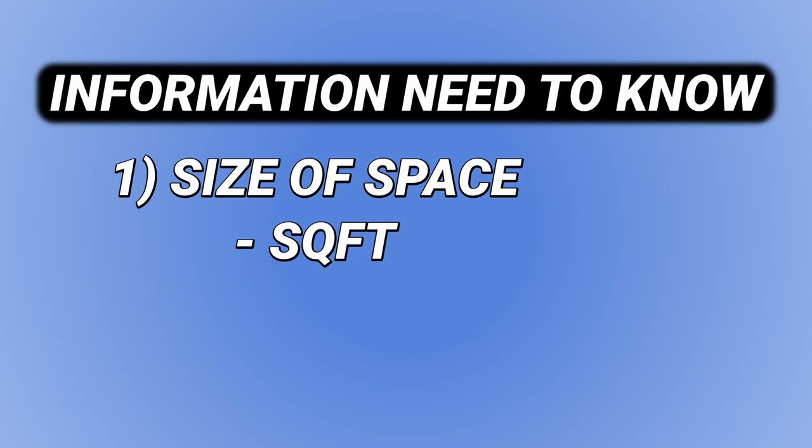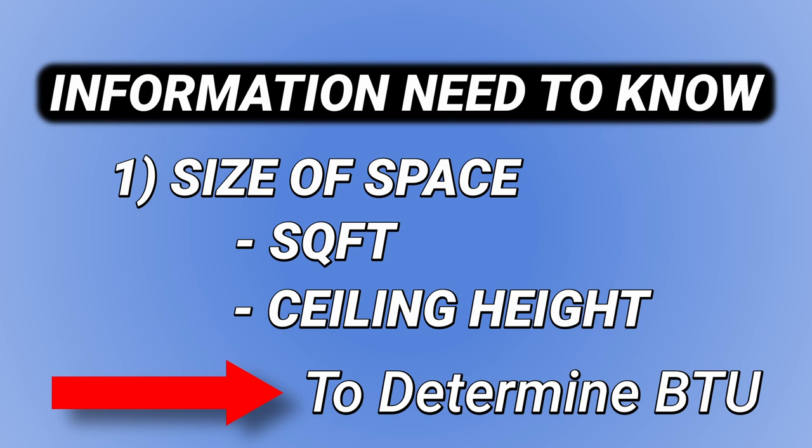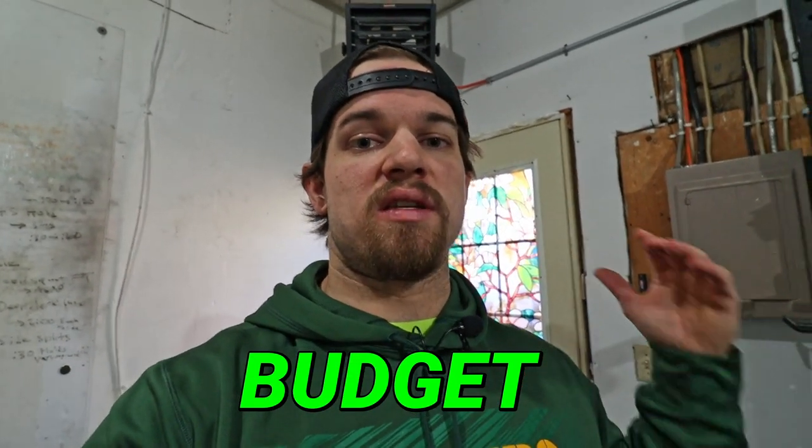Up above my head here is a garage heater. Before you go out and buy any kind of heater, there are some things to consider. You need to know your space size — square footage and ceiling height — to help determine your BTUs and which heater you actually need. You also need to consider your budget and how much you're looking to spend on top of the equipment you already have.